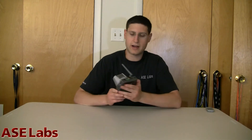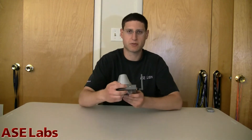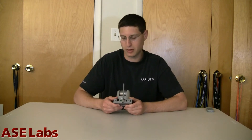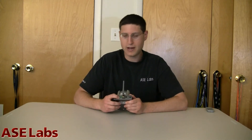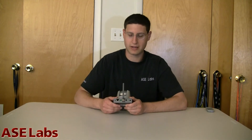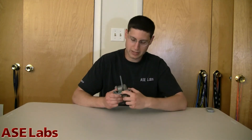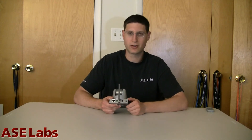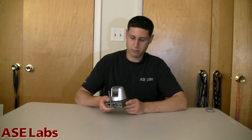As you can see from the antenna, it's wireless — wireless B and wireless G. On the back you have the USB disk mount button and a USB port for capturing images, which we'll go into later. There is an ethernet port for wiring it, because most security people will tell you not to use wireless. There are GPIO ports for general purpose input/output if you want to do alarm triggering or other functionality. There are some vents here because the unit does get quite hot, and also the DC input, the reset, and the speaker out, which is an interesting feature we'll go into later.